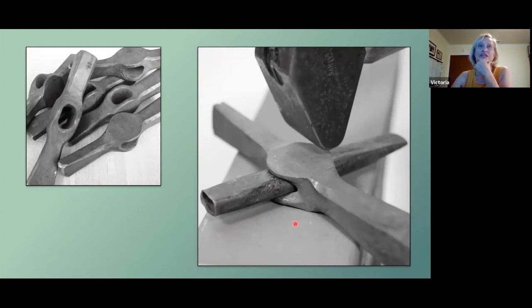Another kind of drift is one that you would push in one side, but it's so wide on the other end that you would never push it all the way through. Its intent is to just widen or set a taper on one side, and then usually the other side of a hammer, creating a narrowing in the middle which gives the handle a better chance to hang onto the hammer head. So this through-and-through drift is kind of like a dinosaur — fat in the middle, thin on one end, and thin again on the other end. This is your struck end, this is the insertion end, and the working bits are in the middle.